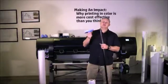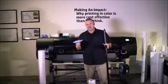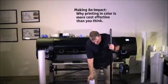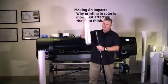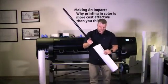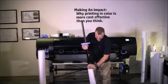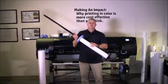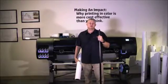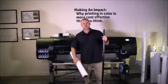For the purposes of this video, I'm going to load a 24-inch wide media roll — it's easier to handle. That's how you load media onto the spindle, and that's how you're going to use the 3-inch core adapters which shipped with your printer.